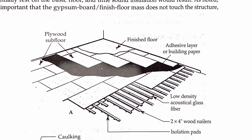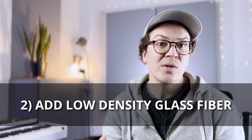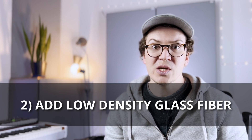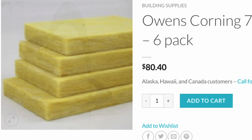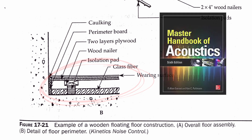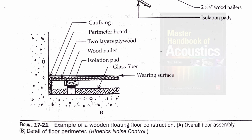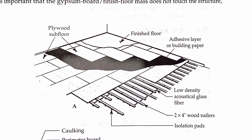The sleeper boards will lift your floor up, and in between all of those sleeper boards you are going to add low density glass fiber. I recommend using Corning 703 — probably the two-inch thickness — placed in between all the sleeper boards. You can see a picture here from the Master Handbook of Acoustics book that shows the three-dimensional layers of this design, as well as a cut-through image of how this design is going to work.